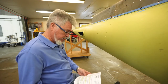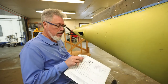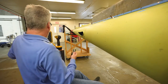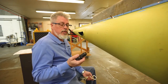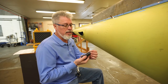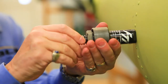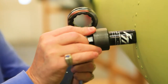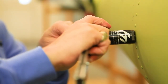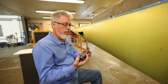Then move on to the next step: after you check the size of the hole, we're going to use the sleeve to cold-work the hole itself. We supply these cold-working tools — it's a reusable tool kit that we supply; if you don't have it, please contact us and we'll get one out to you. With the sleeve onto the arbor, make sure it's tight up against the face — they're very tight. Give it a little push to make sure it's tight onto the arbor. Put this in the hole and bring the nose out a little bit to help hold it in place. Then, using the 7/16 wrench on the outside — which should be in the kit — turn this until you can feel the arbor pull through the sleeve. Once that's completed, remove it from the hole and discard the sleeve. These are one-time use sleeves.